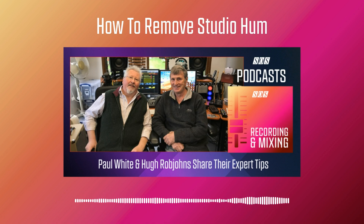Keep away from computers, anything digital — CD players, digital radios — and anything with a big mains transformer, because the pickup coils in a guitar are sensitive to magnetic variations and a mains transformer produces a magnetic field. We did a Studio SOS where they had a very long mic preamp multicore cable that was too long for the room, so they coiled it up neatly behind the desk — then inadvertently placed a mains plug board with a couple of wall-wart type mains transformers right on top of that coil of cable, and wondered why all the microphones were humming. Screened cable can only do so much. We didn't have to move the plug board very far to cure the problem, but sitting transformers on top of audio cables is not a good idea.